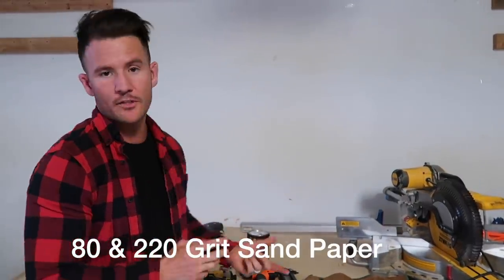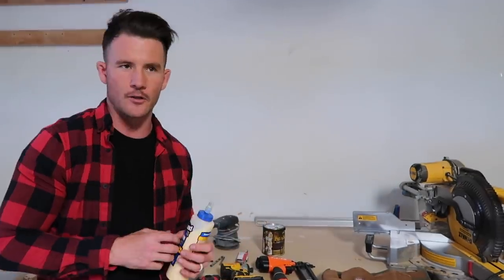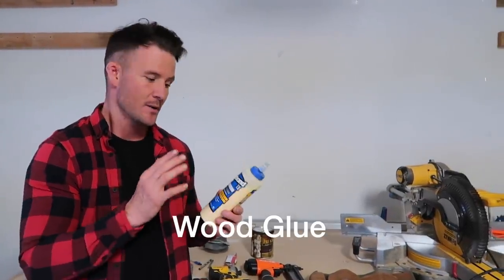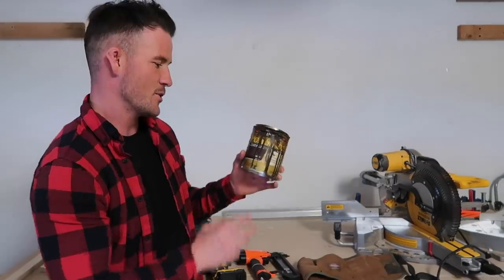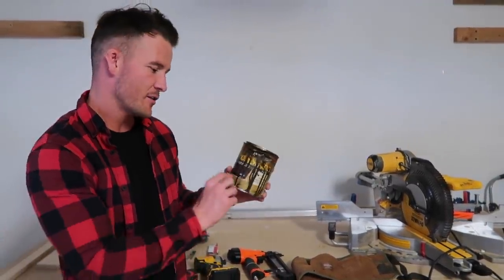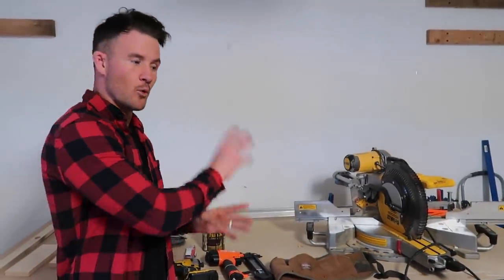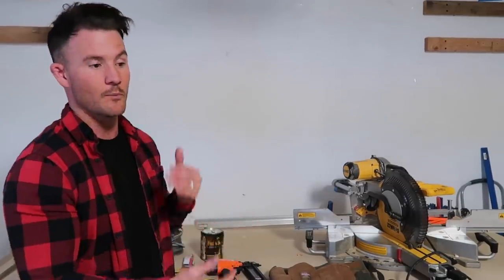None of these tools are sponsored — just the tools I prefer. For sanding, start with 80 grit to get the rough edges and splinters out, then move to 220 to really smooth it out and give it that finished look. Since pin nails aren't the most secure way to hold something together, I always back up with wood glue — it gives that extra strength so you know it's going to last. The stain color I use is honey. Make sure you're using the same type of wood for the whole door, because honey stain looks very different on different wood types. Stick to all pine or white common board.